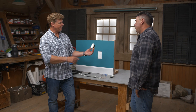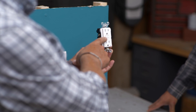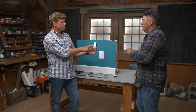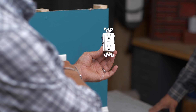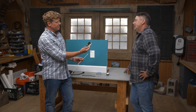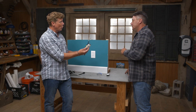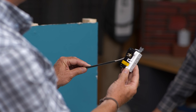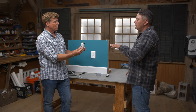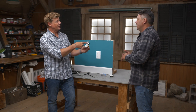You can install this device. It would satisfy all modern code requirements for replacing a receptacle and making it three-prong, even though you only have two wires back there. This is GFCI protected, but it's also AFCI protected — arc fault versus ground fault. When you replace a receptacle, you also have to arc fault protect it. So this device does both — GFCI and AFCI — and it lets you take that two-prong out and install the three-prong without having the grounding conductor. That's an acceptable replacement because it provides two other levels of protection.